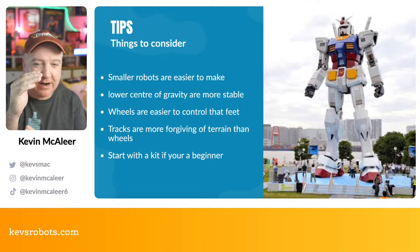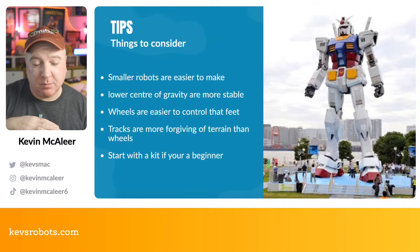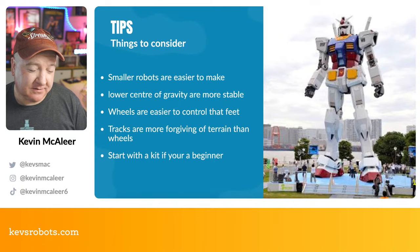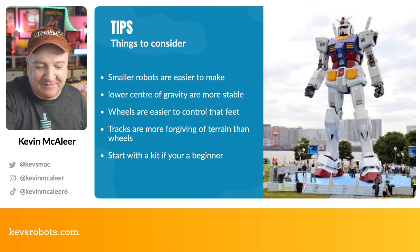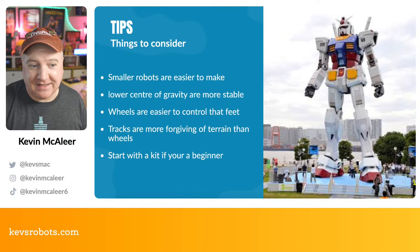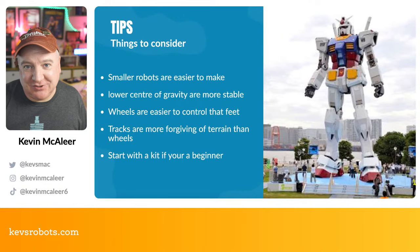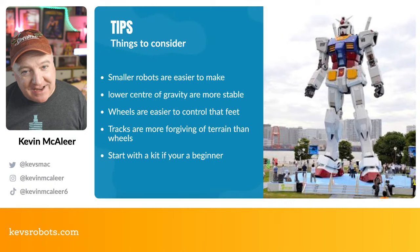Small robots also have a low center of gravity. A very tall robot will sway and be unstable, so you might need to position the battery in the center of the robot to help with stability. Wheels are easier to control than feet — if you make a robot with legs like a spider or hex robot, you have to deal with centrifugal forces during leg swings and may need an IMU to detect orientation throughout the walking cycle.